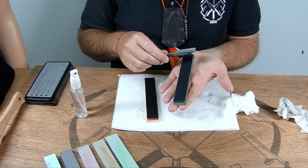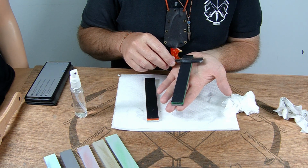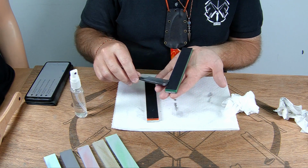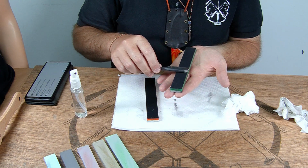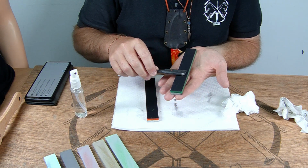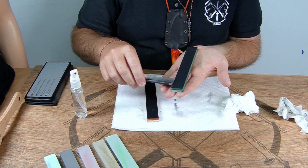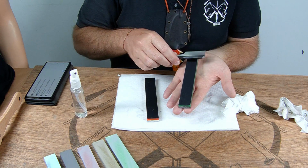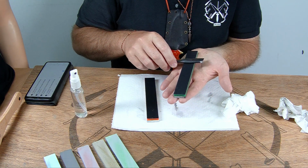So edge trailing, no water. I've already loaded it with the 1/4 micron Jende poly emulsion. So again, no pressure. The nano cloth is here. We don't worry too much about the bevel side being the softer steel, but out of habit, I already put a little bit more oomph on that side. So just 5 or 10.